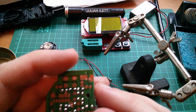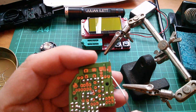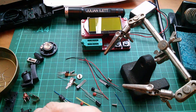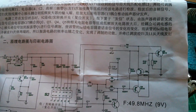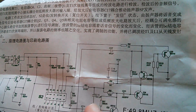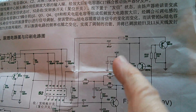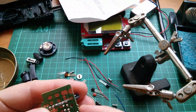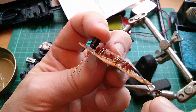These are 100 microfarads, both of them. Let's check the list — 100 microfarads is C15 and C16, just seeing if I can see whether there are any clues to POS and NEG. One clue here is that the two grounds are connected together, the two positives are separate. That could well be reflected in the circuit diagram. C16 and C15 — they're both grounded but at different points. One is directly on VCC, and the other is on this point here, and there's a 1K resistor between them.